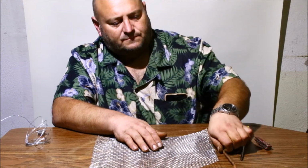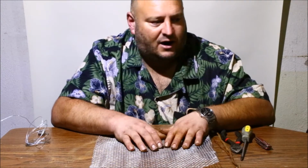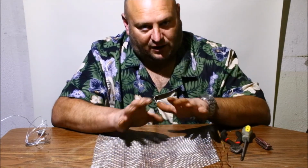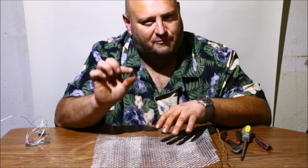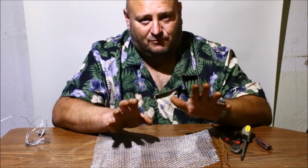I keep an eye on it. I never leave my electrolysis unattended. Mine is ventilated near a window to the outside, which I recommend you all do. Make sure there's a bit of off-gassing with salt. There are some concerns about chlorine gas, but it's very, very minuscule, nothing to alarm yourself with. It will dissipate, and as long as you're ventilated, no problem.